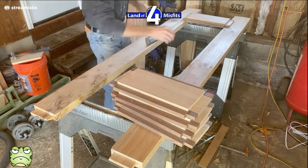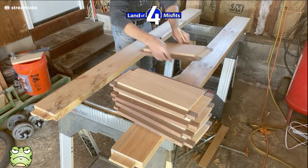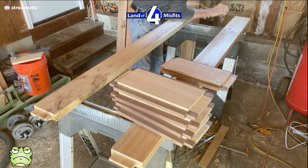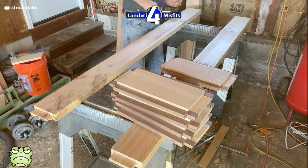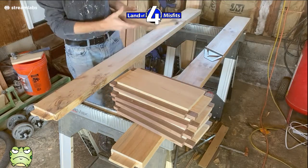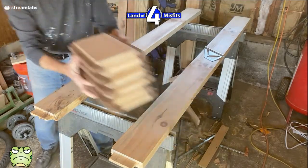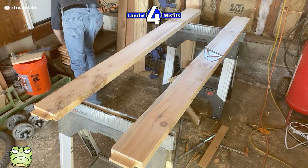Alright, and 1. Go. And that's where our mortise is going to be cut, and all we've got to do is get a 1/2 inch centered, and it's going to be as close as it can be. So get them all. Move these over. Actually, we're going to leave them over here somewhere. Otherwise, we're going to be in the way.